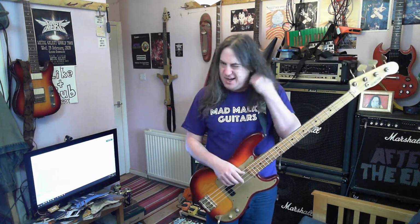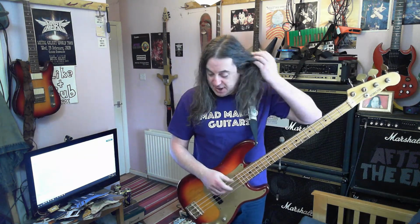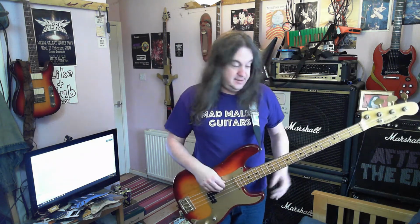I'm wondering if the guy does like the Eric Clapton mid boost circuit. I've got a Washburn G15 that's got a variable. It's basically a similar sort of thing, apart from it only affects the mid frequencies. Eric Clapton has a similar thing in his Strat, like a mid boost circuit. I wonder if he does one like that, because I'd imagine the actual amplifier bit is there, so it'd just be a case of having some caps so it didn't amplify the bass and the treble and it boosted just the mid. That's probably alterable on your own.